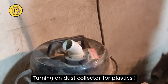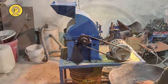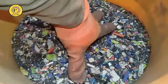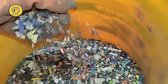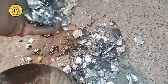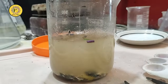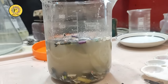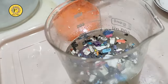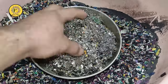I put the screen back inside the hammer mill and continued milling the pins to get all pins separated from the plastic. Here is the crushed materials ready for gravity separation. I tried to separate the metallic fraction from the plastic through flotation in saturated magnesium sulfate solution, but it wasn't successful for all plastics. So I decided to use my pan to wash the plastic out. As the result, almost clean pins with the plastic removed.